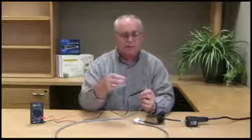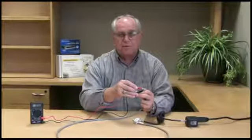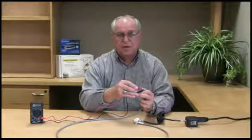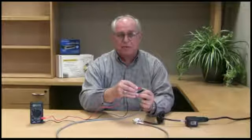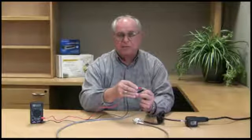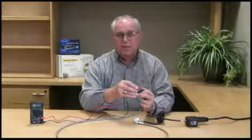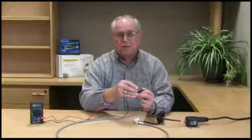Finally, one last thing to check is our cable connection out at the amplifier or amplified antenna to verify we have our 15 volts DC. Once again, put the black lead on the outside of the connector, the red lead on the center conductor, and we should have our 15 plus volts, to verify we do not have a bad connection or a bad cable preventing the voltage from reaching our amplified device. If we have the voltage at the end of the cable and the device still does not work, then we have a problem with the amplified antenna or the preamplifier.